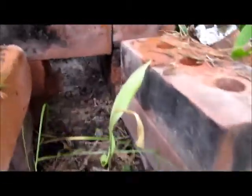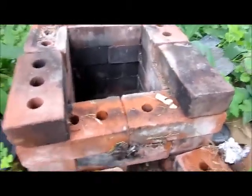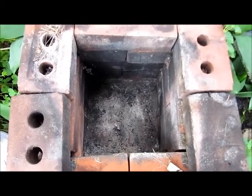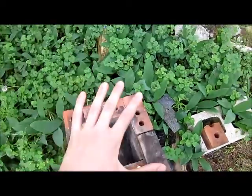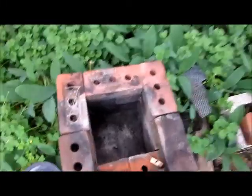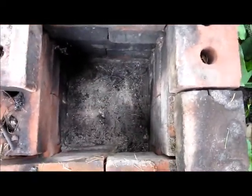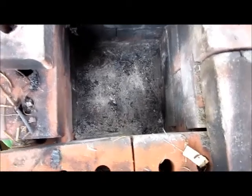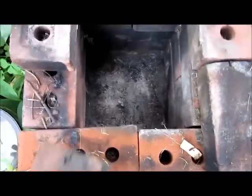Right here is the little opening for the fan. I kind of want it to make almost a spiral, but that's hard to do unless your fan is really powerful and you have everything set up right. This is meant for charcoal — you can either use briquettes, homemade stuff, or chunks. Normal coal could probably work too. Then on top of this you put a garbage can lid, which works the best to keep the most heat in. Right on the bottom are just two more fire bricks — don't use ones with holes on the bottom, you just want it as flat as possible. Then it's just built up stacked so you get the most strength out of the bricks.